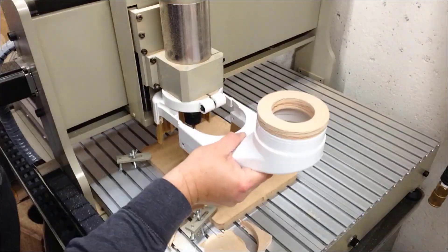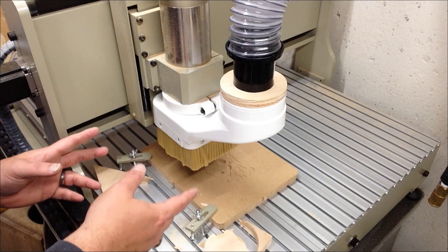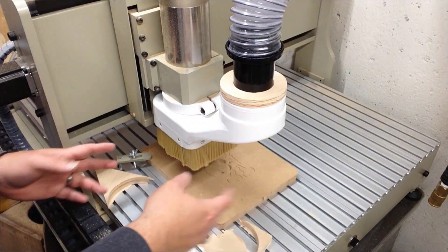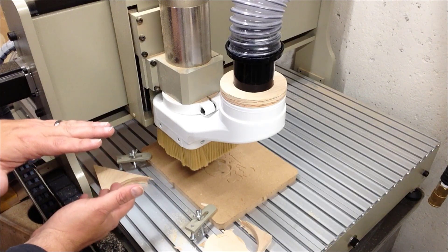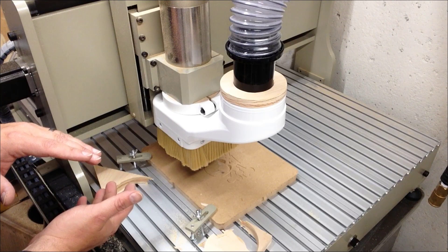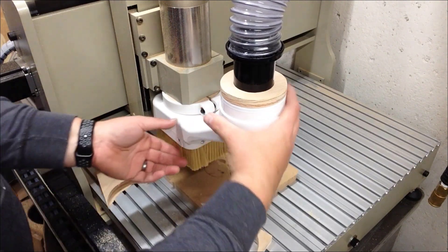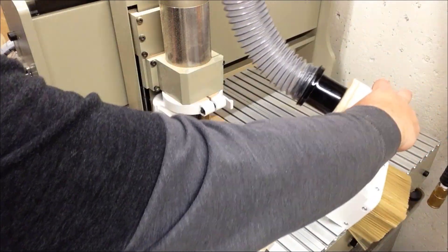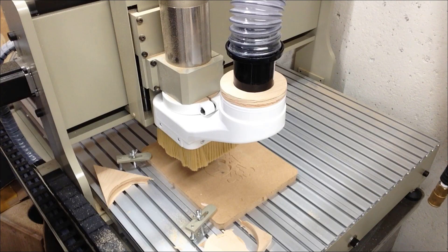I got the whole thing on here and it goes up and down really smooth. My adapter for the hose fits really well. The brushes are pretty much equal with the depth of the bit, though the bit actually sticks out about an inch and a half, so it's going to be a little too tall for a V-carve bit unless I get a half inch one. But this pops off pretty easy — I can set it to the side, change my bit, and put it back on when ready to run.